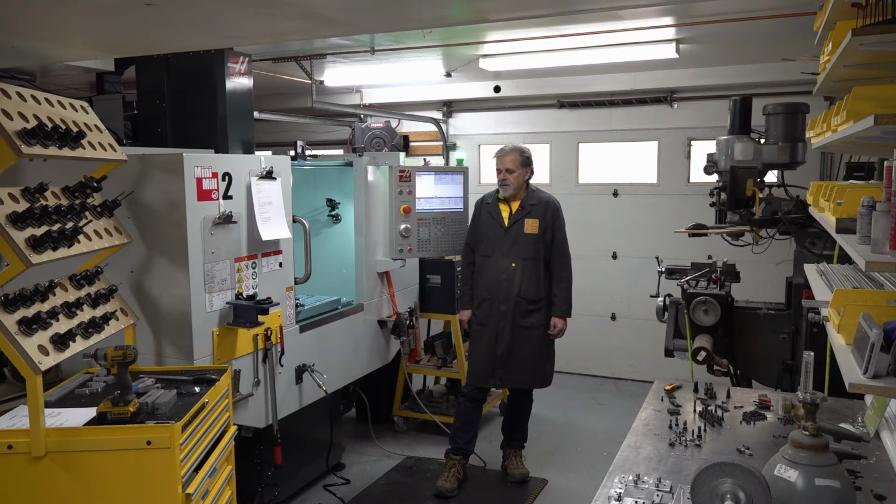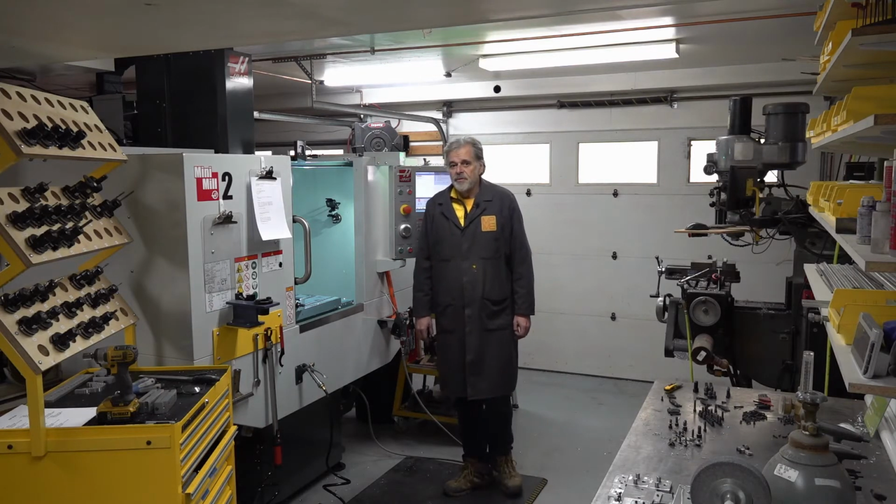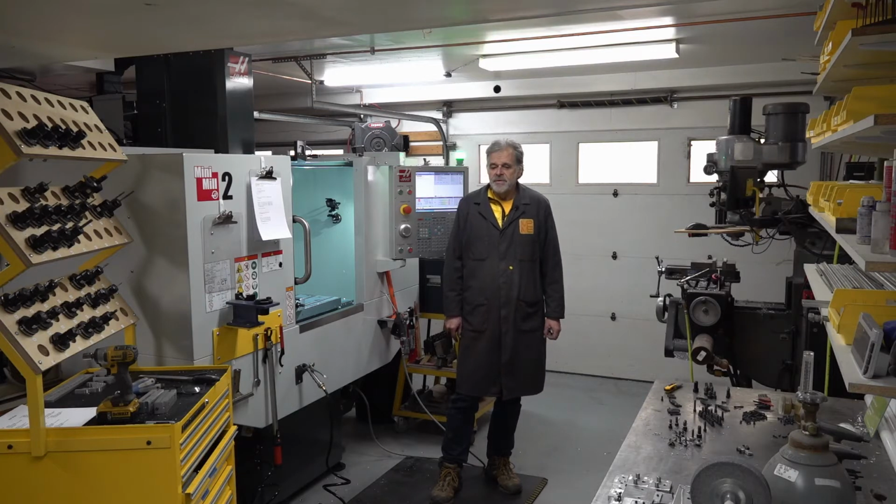So to start off, and I am starting kind of from scratch here, I'm going to verify that one function, that a single part is made correctly. I've also made a new set of soft jaws with a smaller ledge. My normal soft jaws have a 300 thousandths ledge, so I can hold a piece of 3/8 or half material and go over the sides a little and not ding up the jaws. For this, I'm using 1/4 inch material, and the cutter will go outside the boundaries of the part, so I don't want to dig big holes in my jaws. So I now have a full set of 4 jaws with 200 thousandths depth ledges, and hopefully everything will work.